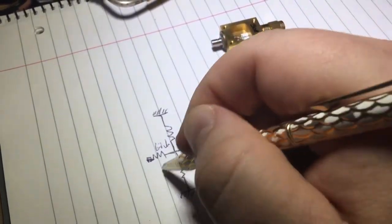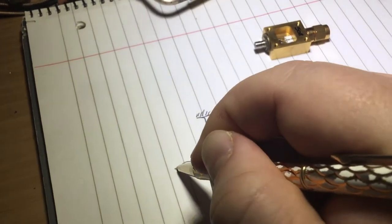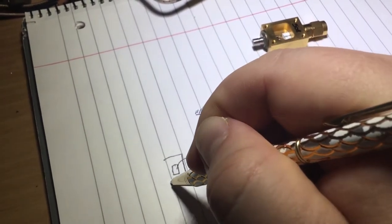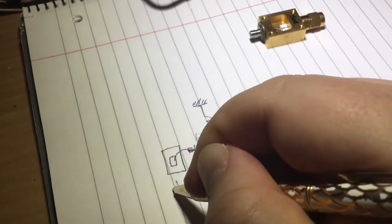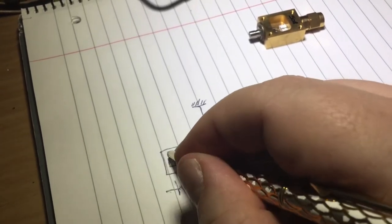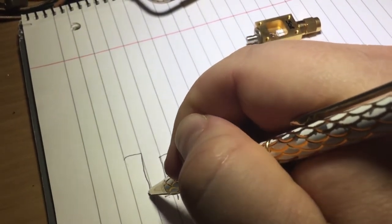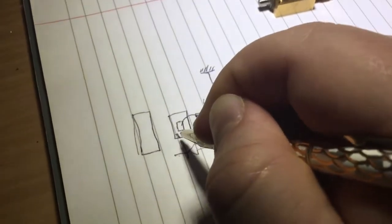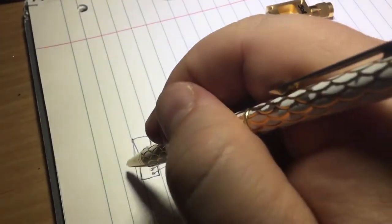That resistor and the previous resistor added together make 50 ohms between that point and chassis. I think I measured around 67 ohms for one of them. Then there's a bond wire from that to the tiny black grain of rice which is the diode. Underneath the diode, sat on a wafer, is the opposite side of the diode — the bond wire connects to the anode, and the cathode is the plate underneath.